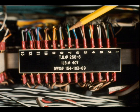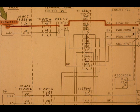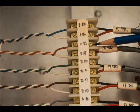The wiring between TB2556 and IJB407-TB2556 is a multi-pair cable. This is the cable leaving TB2556 and going to the IJB. IJB407-TB2556, Terminal 1B, connects the plus-24VDC power source to the positive terminal of the transmitter. This is IJB407-TB2556, Terminal 1B. The multi-pair cable wire is on the left. The transmitter wire is on the right.